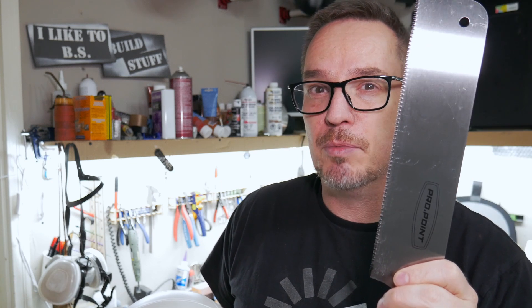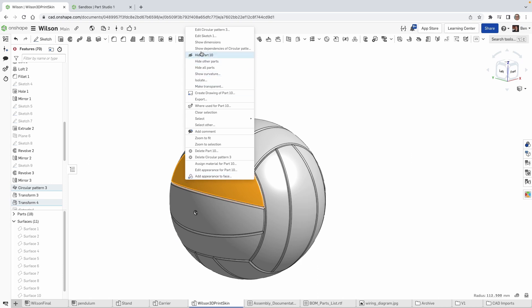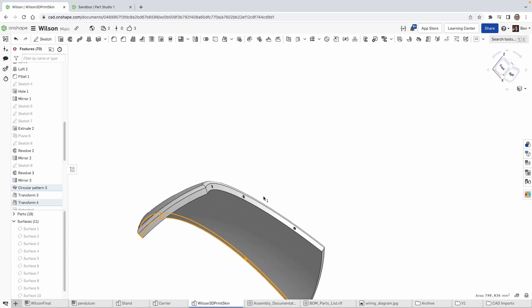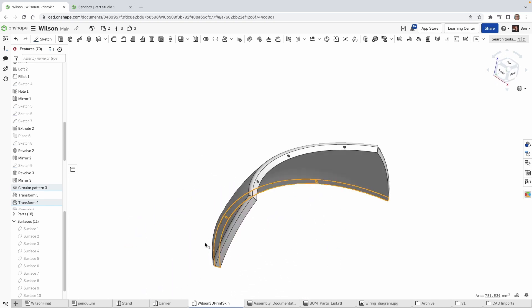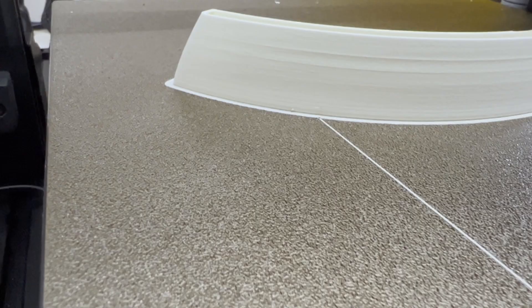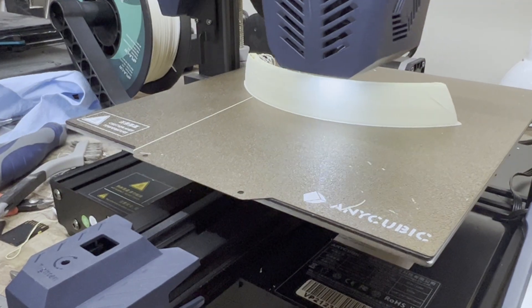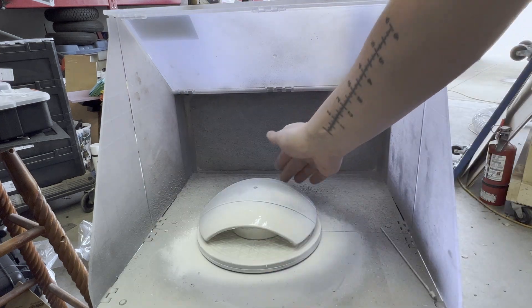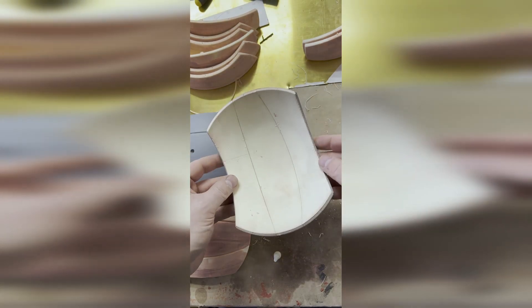If you know how the panels of a volleyball were designed, leave a comment down below — and you don't have to cut a ball up with a saw to find this out. An added bonus is that when we hide all the other parts, each panel has a flat face, and that flat face sits down perfectly onto a 3D printer. Now that we have all this sorted out, let's print out all the panels. We'll glue them all together using alignment pins to keep everything nice and straight, use a little auto body filler to fill in the lines, some sanding, some painting — and we now have what we can use as the shell for this robot.